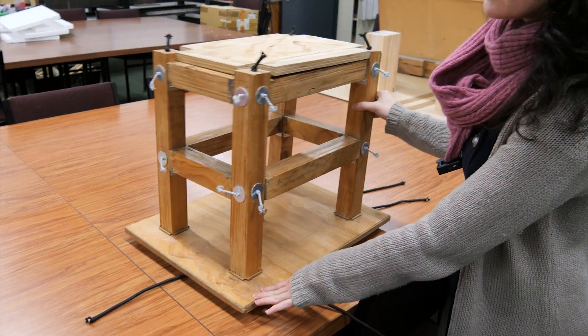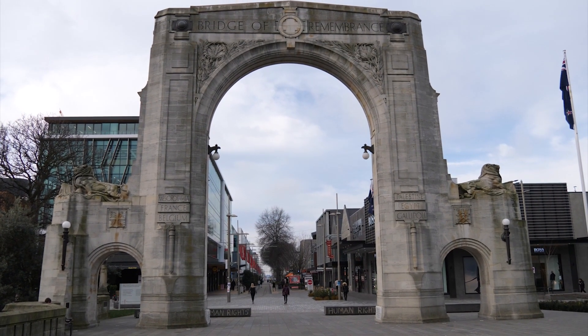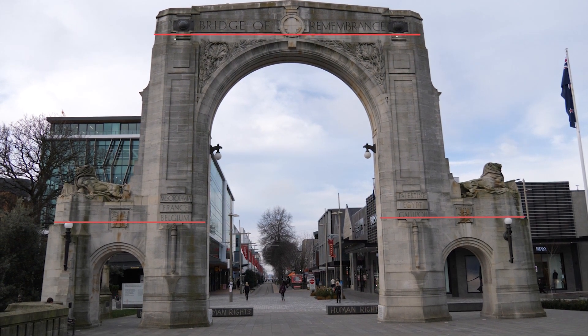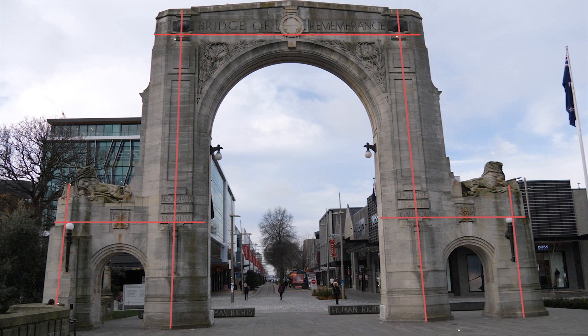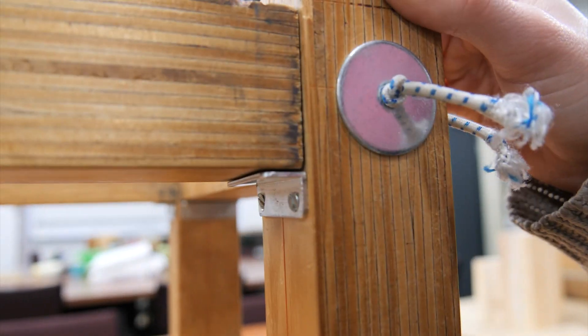Also in this, the structural part — if you remember the wooden structure that had the rocking frame — this is very similar. This one has post-tensioning around each one of the arches, just like those elastic bands going in each one of the columns and beams. The rectangular post-tensioning in each one of the arches allows the structure to rock, and then pulls it back after the shaking, just like we saw in that wooden building.